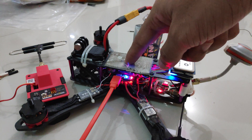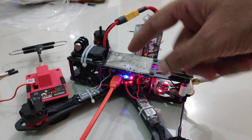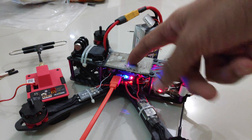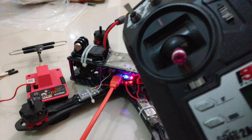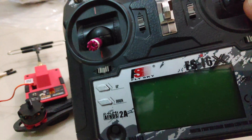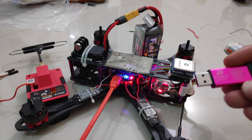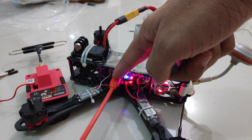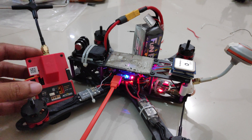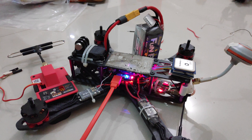From my experience, using the no-button bootloader file is the best option. If you're wondering how to flash the no-button bootloader file on the R9 MX receiver, check out my previous video where I explain thoroughly how to flash ExpressLRS using the STLink method. Since I'm using ExpressLRS with the Flysky i6X radio transmitter, I cannot update or make changes to the firmware from the radio transmitter, so for the very first time I had to use the STLink device. After that I can use the Betaflight passthrough method for the receiver. For the R9 transmitter I still have to use the STLink, but that's not a problem for me.